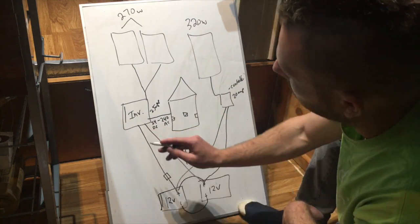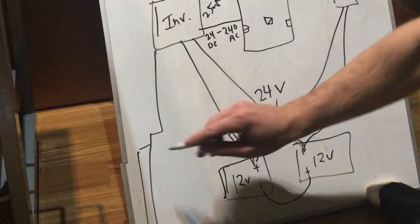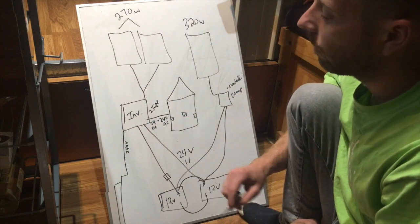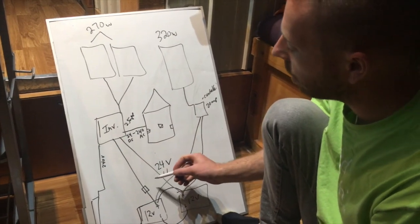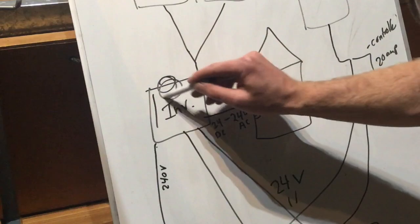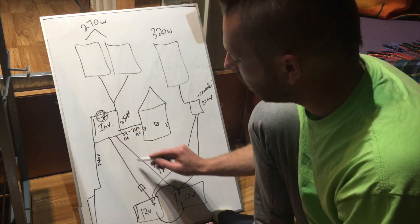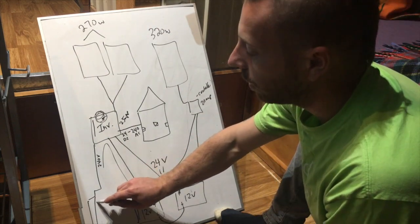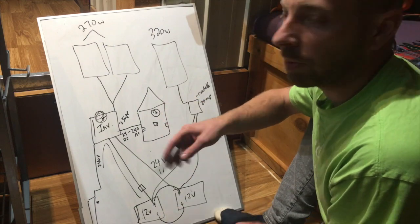Off the inverter, there's also another cable that runs to the power company — that telephone pole there. So this is 240 volts, and what that does is if we have cloudy days for a week or longer and our batteries aren't getting charged by the solar system, this inverter — basically a computer — will say, uh-oh, my batteries are dying, and it will automatically kick in and the mains power will start charging the batteries. It doesn't happen very often here. We also have mains power to the property because I have a workshop shipping container where I do welding and stuff. The house is generally off the grid; the shipping container is just mains power.